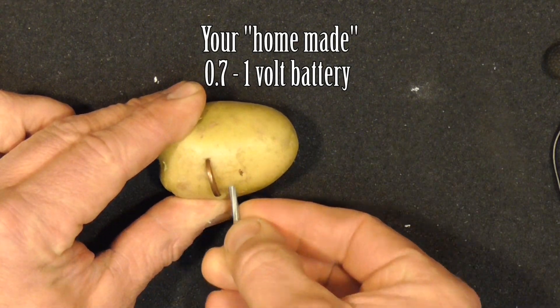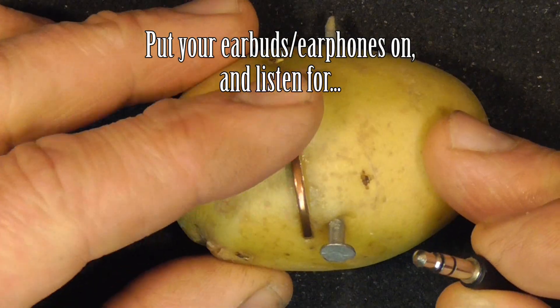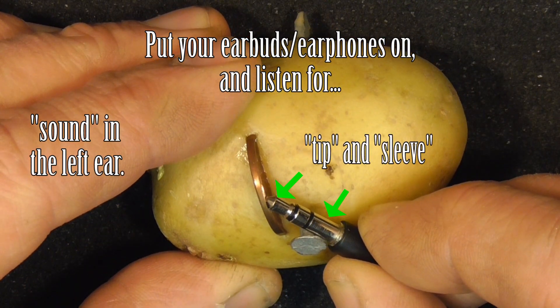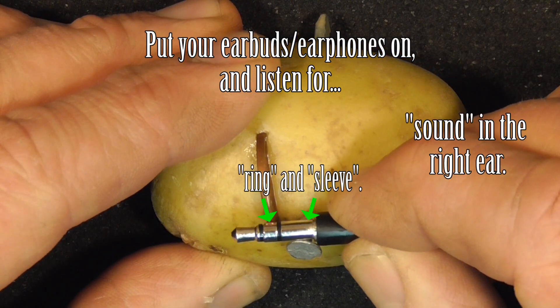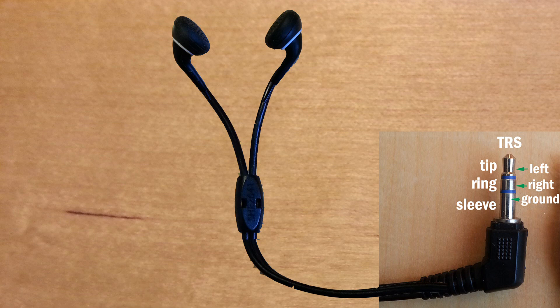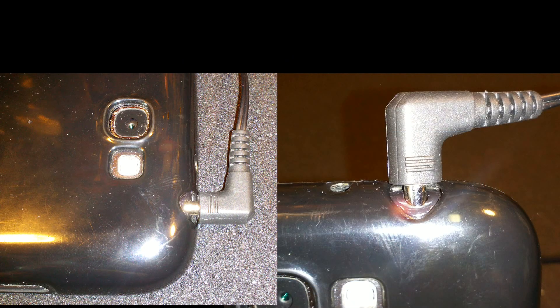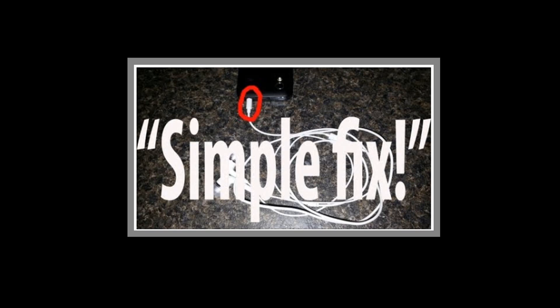And now, if you don't have an ohmmeter, this way will work to check for electrical continuity. A copper penny will work just fine with staples too. You're creating a small battery that will drive each voice coil in the earbuds — a very small electric current, but enough for you to easily hear. If you hear sound clearly in both ears, there are no broken wires and you can stop right here. If the sound is muffled in one earbud, it could be blown or contaminated with some kind of buildup. Make sure your phone case isn't stopping your connector from going in all the way, because that will make your earbuds cut out too.